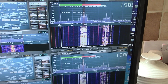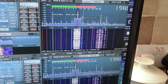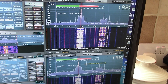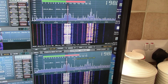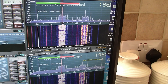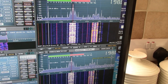On the top we have the LZ1AQ, tuned into the Droitwich transmitter on 198 kHz — a very large signal — giving about 55, over 50 dBs of signal to noise. On the bottom we have the Welbrook loop, again giving around 50 dBs. Looking at these two spectrum plots you would really have to conclude that the performance of both is very similar, and therefore perhaps part of the differentiating factor comes down to price.